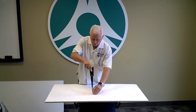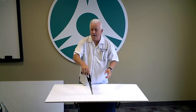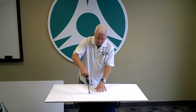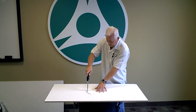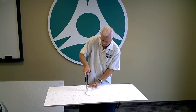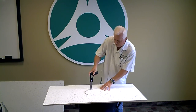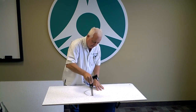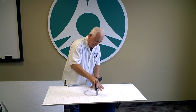We're going to take a fine-tooth drywall saw — the fine tooth allows a cleaner cut. We want to cut on the outside of the line we just drew. You can have up to six tiles stacked, and you can see how easy it is to cut. The reason for the trash can is: one, it's a nice support so I don't have to bend over, and also when I'm done, all my debris falls into the trash can, keeping my work area tidy and neat.